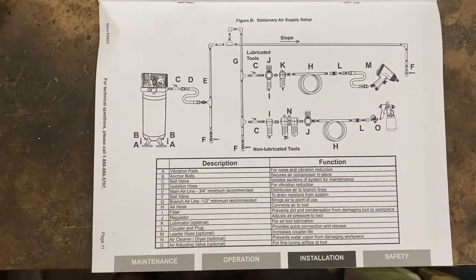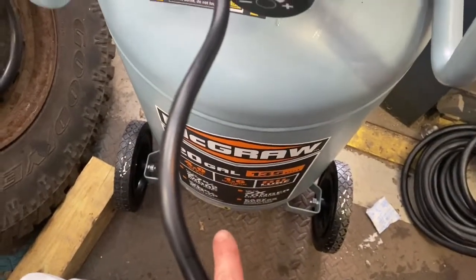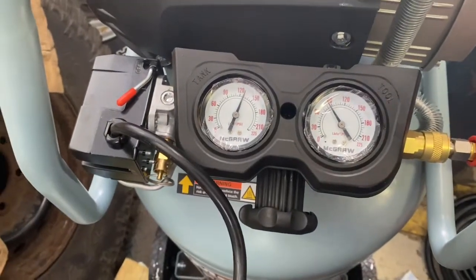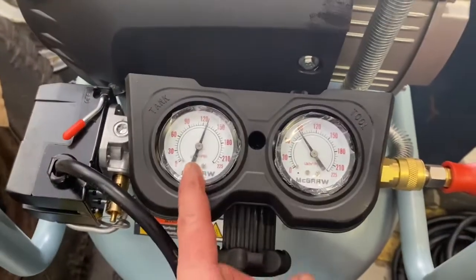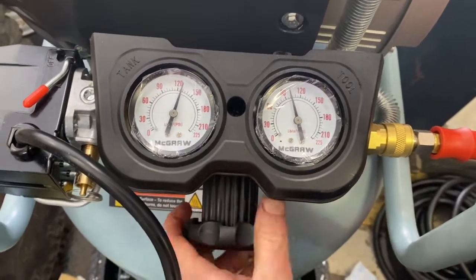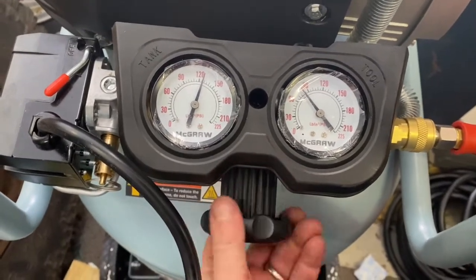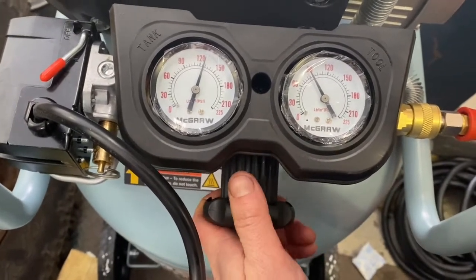Let's hook some lines up and see what we can do. I just finished warming everything up. I shut the valve at the bottom, fired it up, and it got up to pressure. It took about maybe five minutes to get up to pressure — it really wasn't that bad at all. This is your tank pressure, this is tool pressure, and this changes tool pressure. If I do that, more pressure goes through the tool; if I do that, pressure bleeds off. Less pressure goes through the tool, which you don't need a whole lot for the tools I use. I'm thinking right around 90 is probably good.